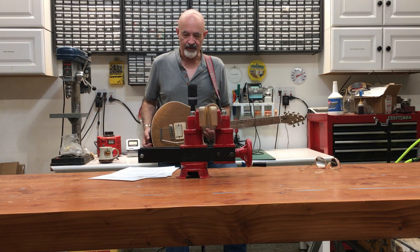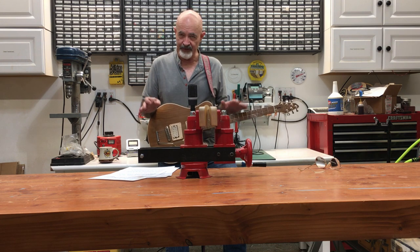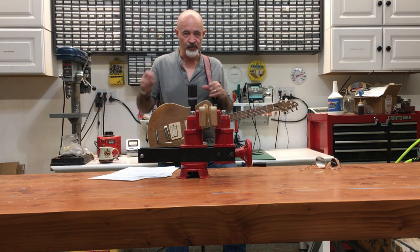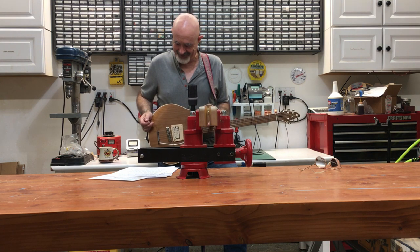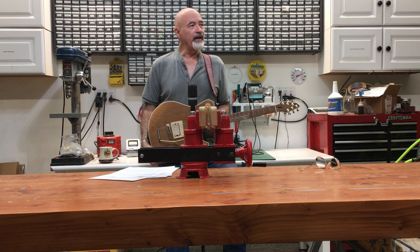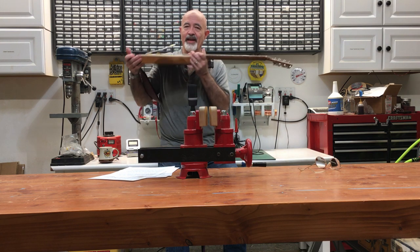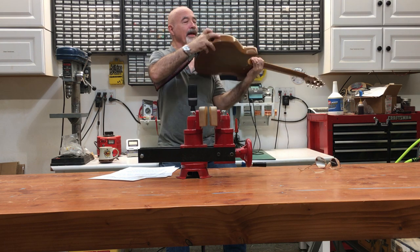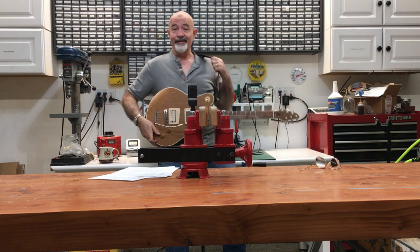In the process of routing out the body outline, I laid the template down on it, and on my table router proceeded to route out the outline just like everyone does. I found out later that it was because I was running the RPM on the router a little too slow, and a big ugly chunk was taken out that I ended up having to repair. But hey, this is just a prototype,